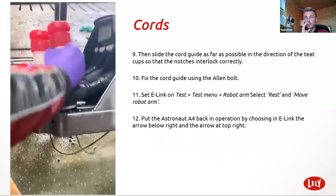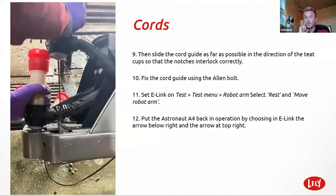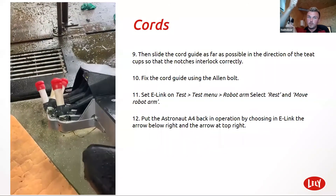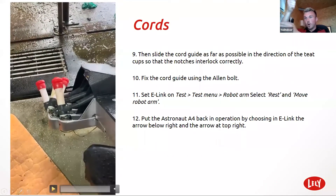As a rule of thumb, that normally works — this time I was quite lucky to do it first time. That's about the length of string you need. When you pull firm, you should be able to see the notch from the bottom of the cup. The notch of the liner should be at the bottom of the cup. It's really important that you don't have the string too long. If it comes too far above the cup, it won't retract all the way, and you'll have problems with washing and all sorts of problems. So the string needs to be pretty much perfect every time — if it's too short, you'll have attachment problems.